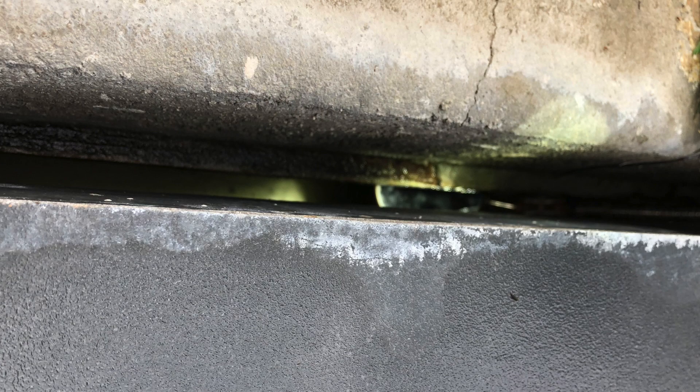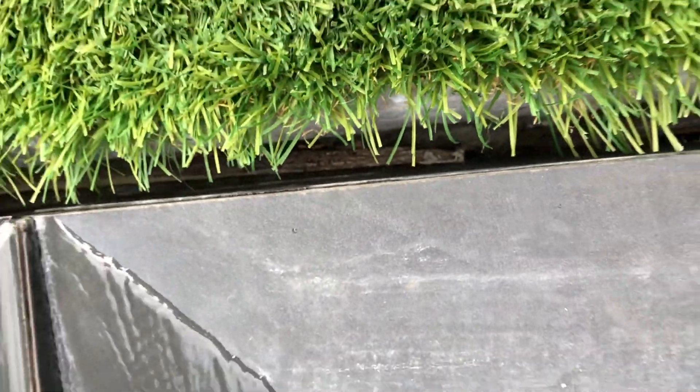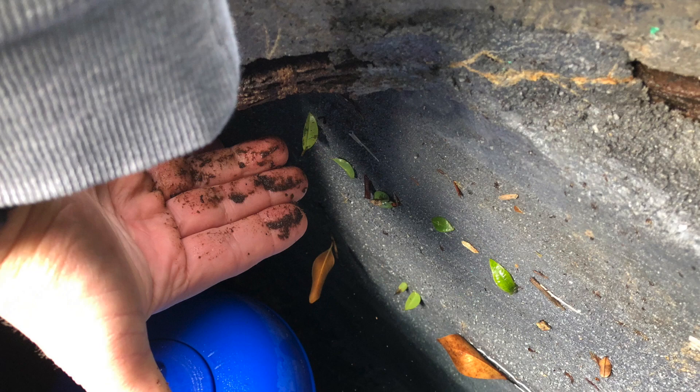If you look, you'll see the wood lit up right here. In these slot drains we're actually pulling the wood out of the way — as water runs over, it's getting out of the actual vessel. This is a leak we would have never heard. This is only something we can visually see and determine is leaking when it's running. That's how we did this leak detection. They're building crazier now with these slot drains.